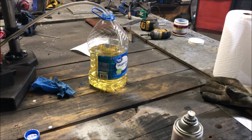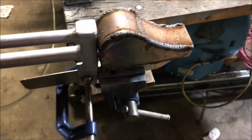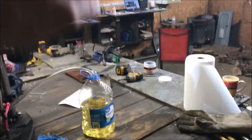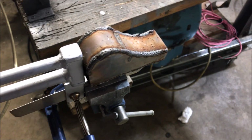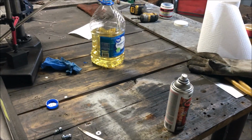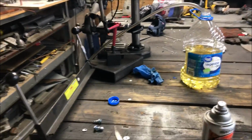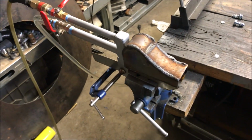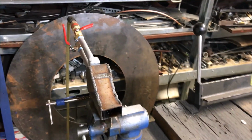Now that was with the fuel tank at that elevation. So technically my torch is slightly higher. And all that flame adjusting that you've seen was me lifting the fuel tank up and down to observe the effects of fuel elevation. And the blue flame may have been a constituent of just the perfect ratio being available through these similar elevations of the torch and the burner. But man, dude, that was gnarly. That was pretty awesome. We're not done messing around with this thing just yet.